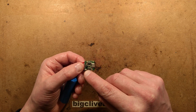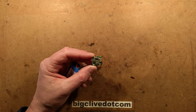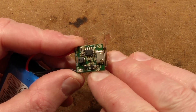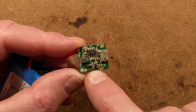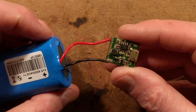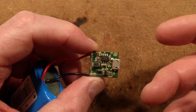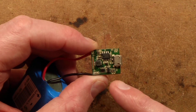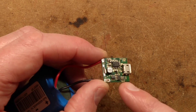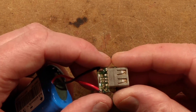We have a 1.5 microhenry inductor by the look of it. Interestingly, we've also got the DW01 and the MOSFET, so this is over-discharge protection. That's interesting — that would explain why when I got this and tried plugging a load in, it didn't power anything. The DW01 is designed to protect the battery and would probably cut off at that point.